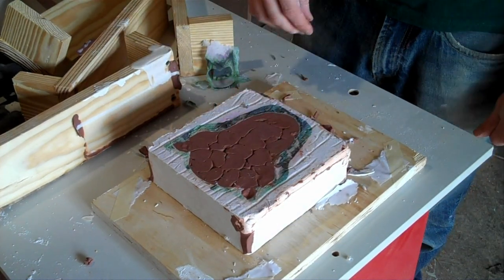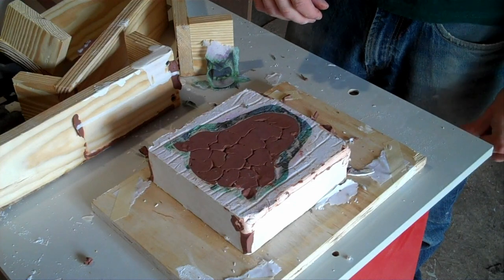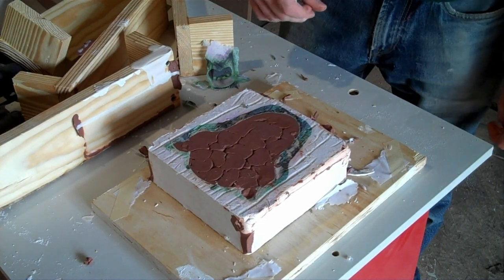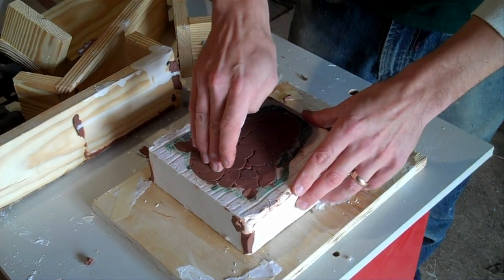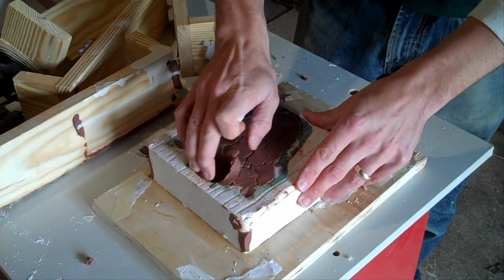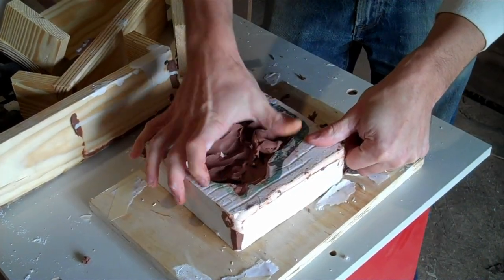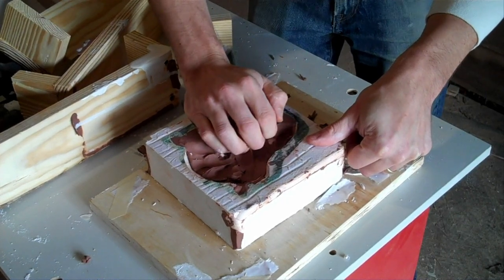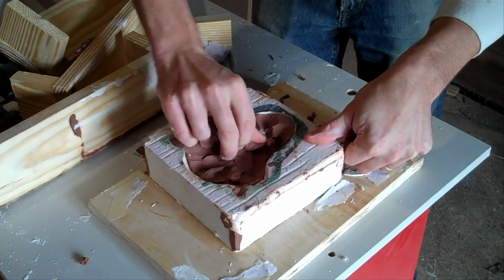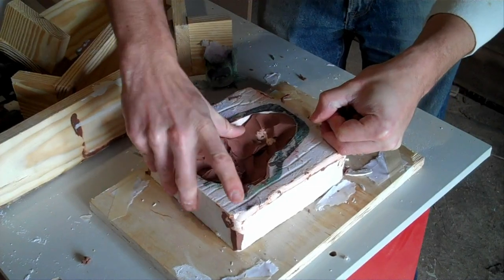Now to get the oil clay out, we're basically going to have to start digging it out of the plaster, being careful not to disturb the actual mold surface. So your oil model is essentially destroyed at this point, and you're just going to ball it up into a big ball of clay. If you wanted to save your oil clay model, you could cool everything down until the oil clay model is hard and rigid, then you might be able to peel it out. There will be some distortion, but it should be easy once it's out of the mold to place it back to how it was.